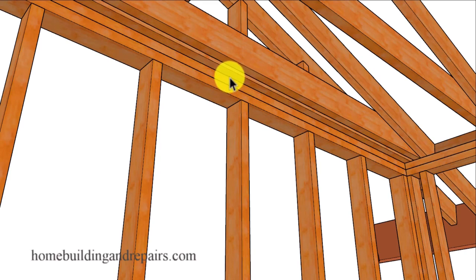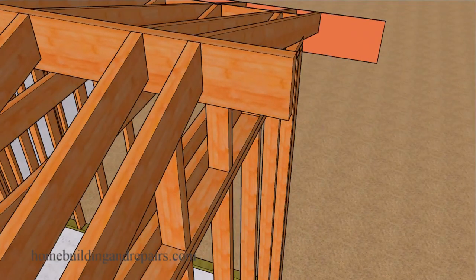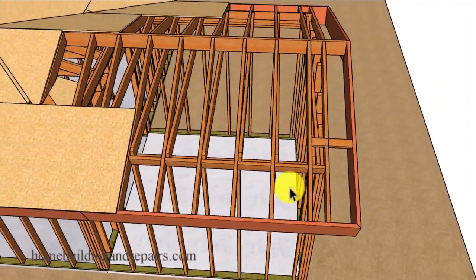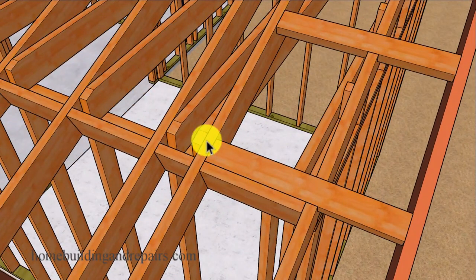We will need some ceiling backing for the drywall, and we can use a 2x4 for that instead of a larger piece of lumber like a 2x6 that we're using for our ceiling joist. If you're going to use this design, make sure the ridge extends past the side of the rafters or the end of the wall framing so that you can attach the fascia board to it. I'm going to provide two different assembly methods for the lookouts — the first will be to move the rafters back along with the ceiling joist to get a longer board that might help with our cantilever.